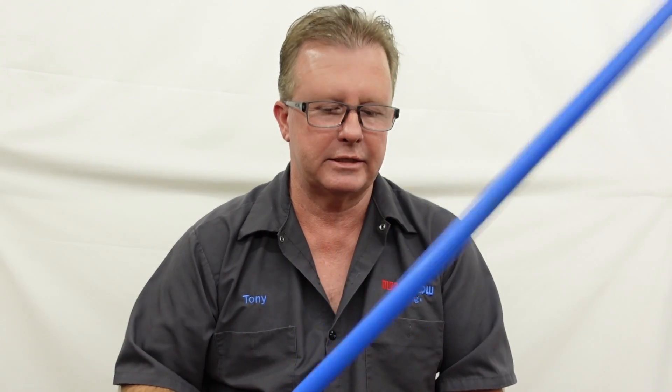It's just a matter of preference and what you like. One other thing I'd like to point out is that if you have OCD like I do and are continually obsessed with how things look — the term plumber comes from 'plumb,' meaning straight — when you see a house plumbed with PEX, looking down the line in a basement you see a wavy line. If somebody knows what they're doing with copper, they can make that stuff look perfectly straight all the way down. It's a little more appealing to the eye.